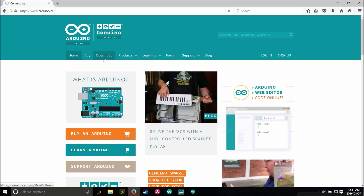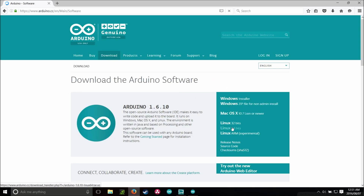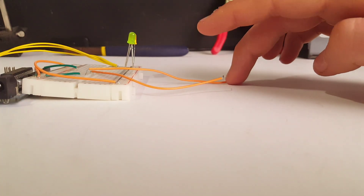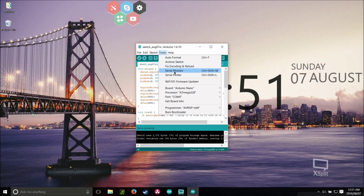To get the serial plotter, go to Arduino's website and download the latest version. To test your code and wiring, press your index finger against the exposed wire of the analog zero pin and your middle finger against the exposed wire of the 5 volt pin and open the serial plotter. Your graph should look something like this.